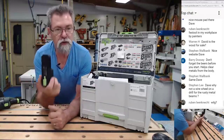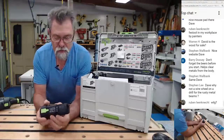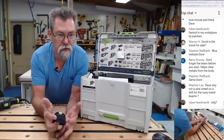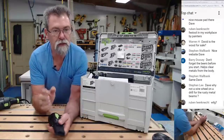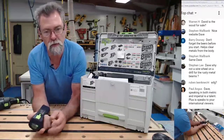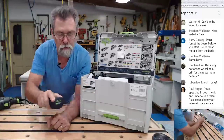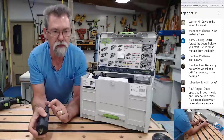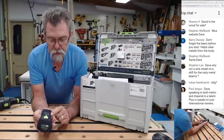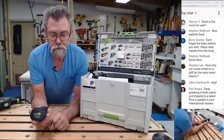So these go into an existing Festool charger. There's two little slots down the side here. I don't know if you can see them. And what they do is they go into the top. Don't try and just put it down on top and drag it into the charger. It won't go. And you'll go, oh, Dave talking through his backside there. You've got to go all the way forward on the charger and drag it back down, making sure that the wings engage into these little slots. So they say 30 minutes charge, and you'll get 25 minutes out of a battery.